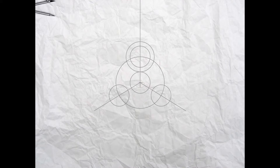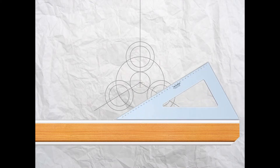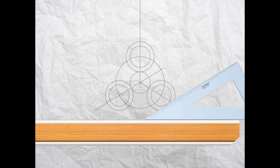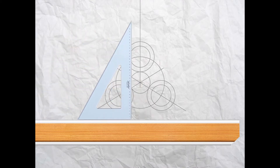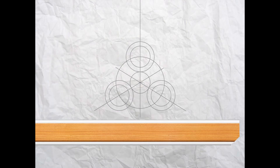Put the point on the right-hand circle and draw another circle, and another one as shown. Now we're going to add more construction lines. With your T-square and 30 degree set square, continue that line up to the large circle, and in the same way continue that 30 degree line up to the left from the center. Then do the same vertically down from the center until it's just past the larger diameter circle.